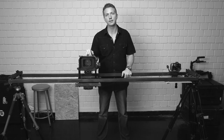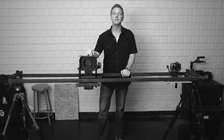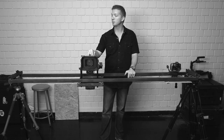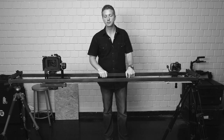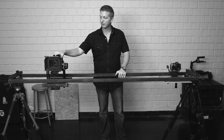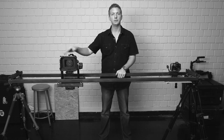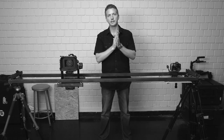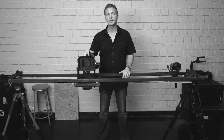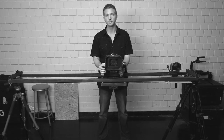This is a seven-foot camera slider made from rig wheels and box track. Box track is an industrial construction material available in lengths of six and eight feet on rigwheels.com. It's strong — this is steel track, so you can put just about any camera on it. It's portable, collapsing the same way as standard dolly track. This camera carriage is built out of the CPM Film Tools DSLR Cage 3.0 we saw earlier.